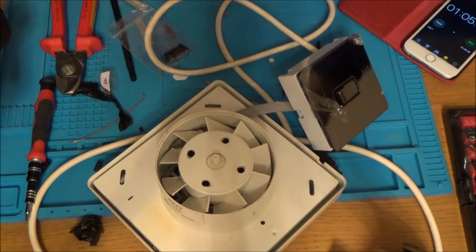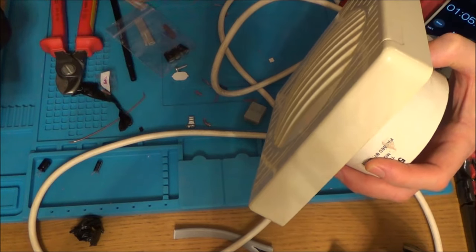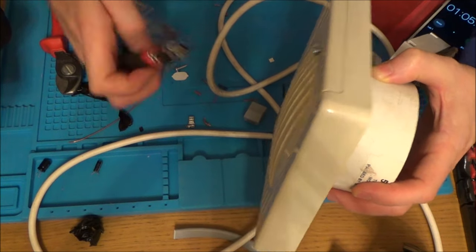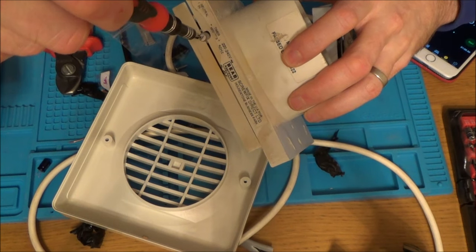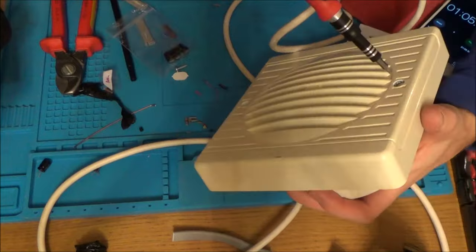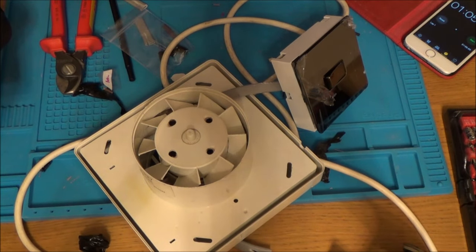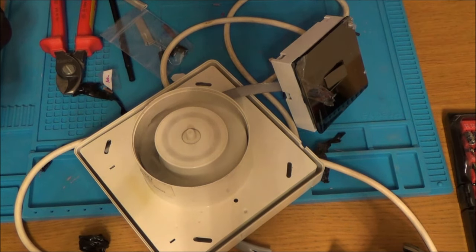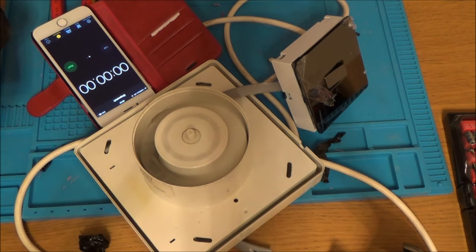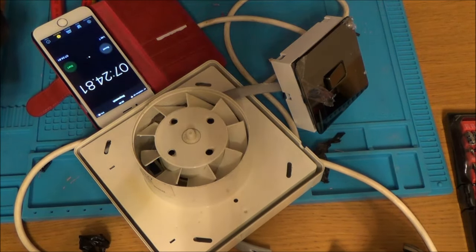Now I'm going to unplug it and move the dial a little bit more around — not all the way to 15 minutes, but probably to about five minutes or so. So now with this setting here, let's plug it in, turn it on, reset the timer, start it and turn it off. So there you go — seven minutes, 20 seconds. So you can see how the adjustment works. I reckon the adjustment range is from one minute to maybe 30 minutes, looking at the amount it goes around.